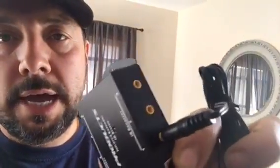But one last thing I wanted to cover before I turn off the video is part of the backup plan. If you don't have Amazon Echo or the Wemo switches, a problem you're going to run into is that when the projector is recessed above the screen or above the ceiling, all projectors use an infrared remote, so you will not be able to power on your projector unless you have an IR repeater, which is this guy right here.